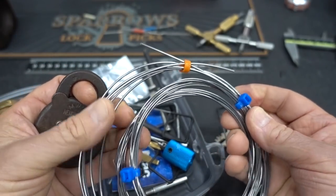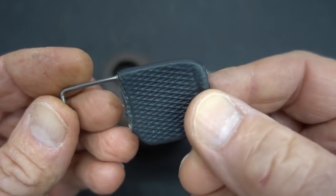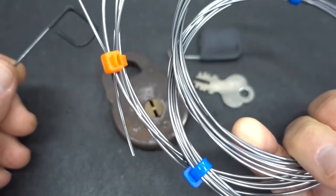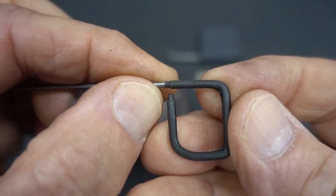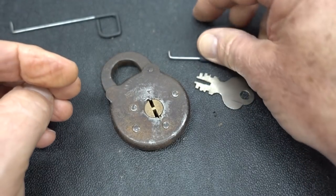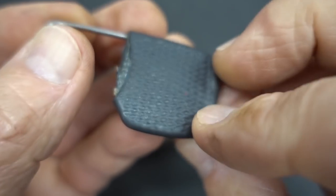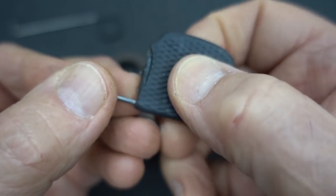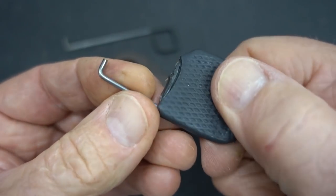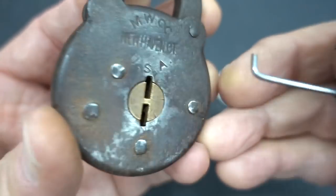What I'm going to do — I've got some wire here. I'm just going to take a piece of wire, cut a bend about that exact length, put a little handle on it, and let's see if we can get into this thing. I got wire in different sizes off eBay — they call it piano wire. I bent the handle just like this, and instead of dipping it in Plasti-Dip, I took some marine-grade shrink wrap and put one layer on it, then a second layer, then clamped it in my vise, which left a really cool crosshatch — good grip. Because it's marine-grade, it's really solid, like solid plastic, giving me a good grip with no flex. Then I put a bend in it and ground it down so it fits perfectly into that hole — just barely slides in there.